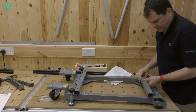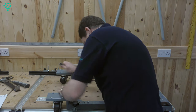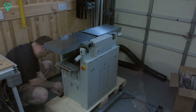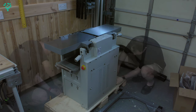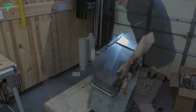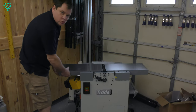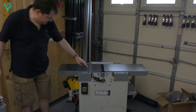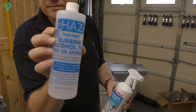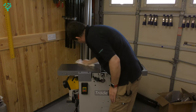Now I want to repeat the activity for the width — the width needs to be 440 millimetres. I put the final brackets together and bolted the frame — assembly done. I then placed the mobile base down next to the planer jointer. There are two black clips, one on each side, which simply unscrew with a Phillips screwdriver. Then it was a case of carefully manhandling the planer jointer onto the mobile base — get a friend to help, this was heavy. Once that was done I can now move it around, and it's all looking pretty good. Still covered in grease, so now's a good time to clean it — I used Excalibur blade and bit cleaner, though rubbing alcohol would work equally well. Spray it on the greasy surfaces and carefully rub it off.